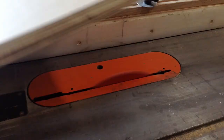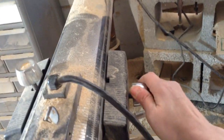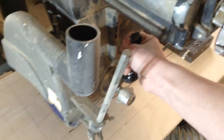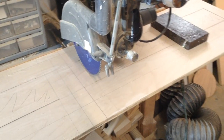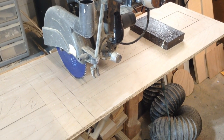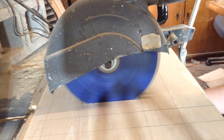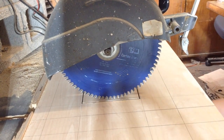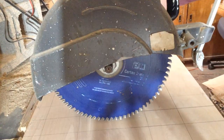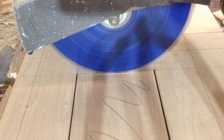There will be some backside marks on this because the blade is circular, but you'll never see the backside — it's going to be permanently attached and never removed. To make a clean cut on the edges I decided to set this up with the radial arm saw. I can lower the blade down into the piece, it's weighted in place, and get those nice clear cuts on my edges. I just turn the blade on, lower it — I have it set up so that it's centered in that panel — lower the blade enough, turn it off, lift it up, and there is that edge cut. There will be a little material left which I'll take out with a handsaw, but I was pretty happy with how this cut.